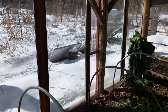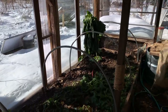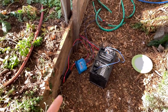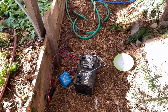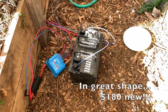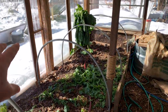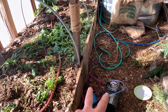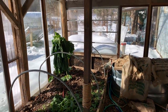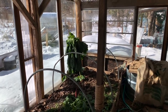You can see the two little solar panels out there. Those two panels are run in series to feed some voltage into this little Victron solar controller. And this is a battery — I went to a local auto repair shop and asked if I could buy a used battery. This was 20 bucks, still in really good shape. So we have the start of the infrastructure to collect solar energy, store it in a battery, and use that to run our pump system. I really want to move towards that so it can be implemented where it's not directly grid-tied. Then we get to the next level: using solar energy to input heat directly into this system.